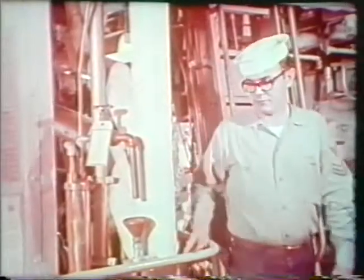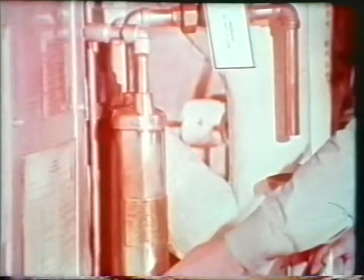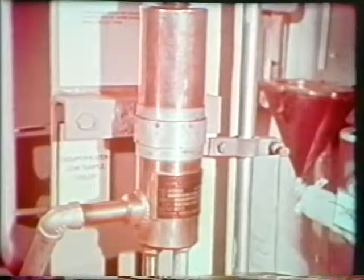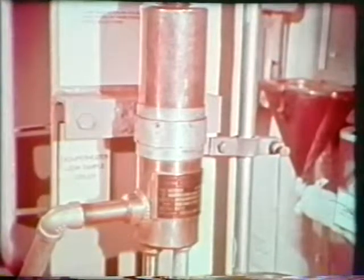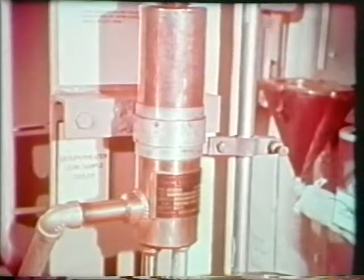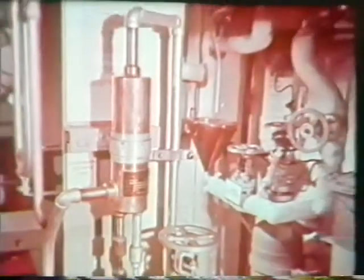Although it is possible to obtain a boiler water sample from a number of locations, a sample taken from the water drum is the most representative of the water in the boiler. A boiler water sample cooler is placed on a line which is connected to the blowdown line from the water drum. A second sample cooler, used for de-superheater leak testing, is located on a line connected to the de-superheater outlet. Sampling procedures are the same for both.